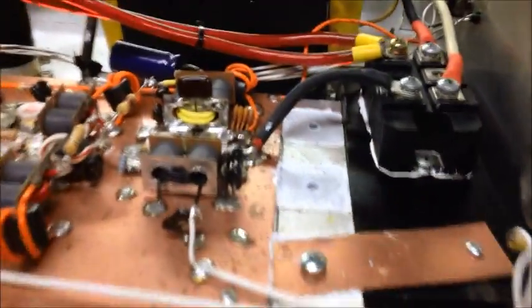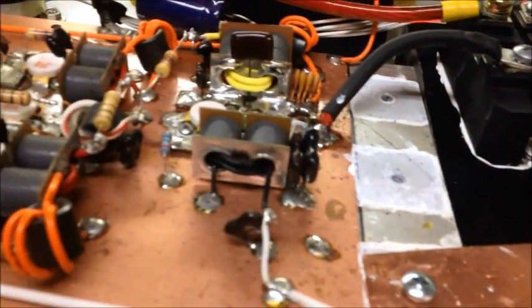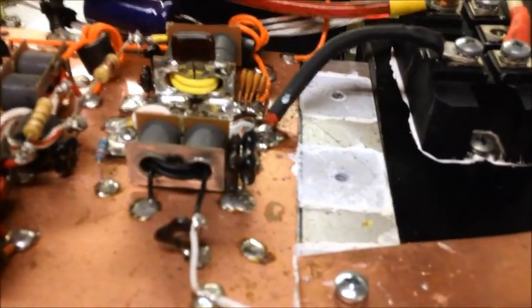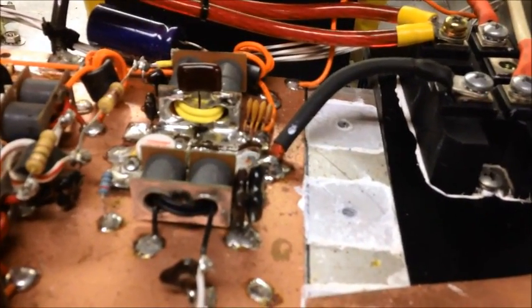What the fella keeps doing is blowing out rectifiers. There are a couple of things that could be doing it. Either he's pulling too much with the watts, which puts a strain on the rectifiers, or he's getting power surges from his power company. Most of the time I overkill on rectification in these things.